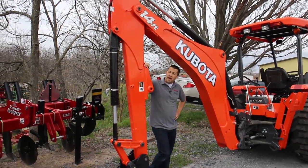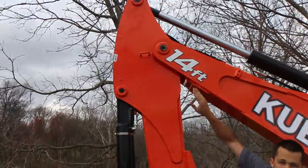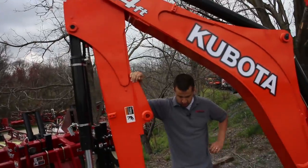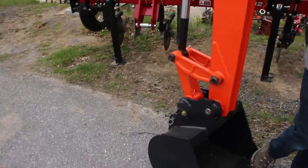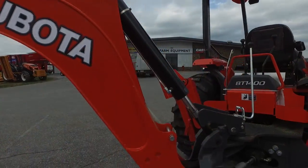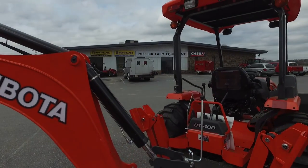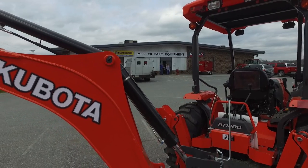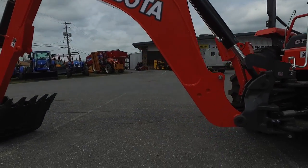That's really geared towards landscapers unloading skids of sod off trailers where they need that high-capacity loader to handle heavy loads safely. Another place this machine took a spec bump is in the digging depth of the backhoe. Kubota is proudly pointing out that this is a 14-foot hoe where the old one was 12. That extra two feet gives you not only extra depth digging down, but also two feet of reach, which is arguably more valuable — you have to reposition less often, helping you be more efficient while digging. The breakout force and power of the hoe itself is about the same as the M59; when they added that extra reach, they bumped up the size of the hydraulic cylinders to keep the backhoe operating like the old machine did.